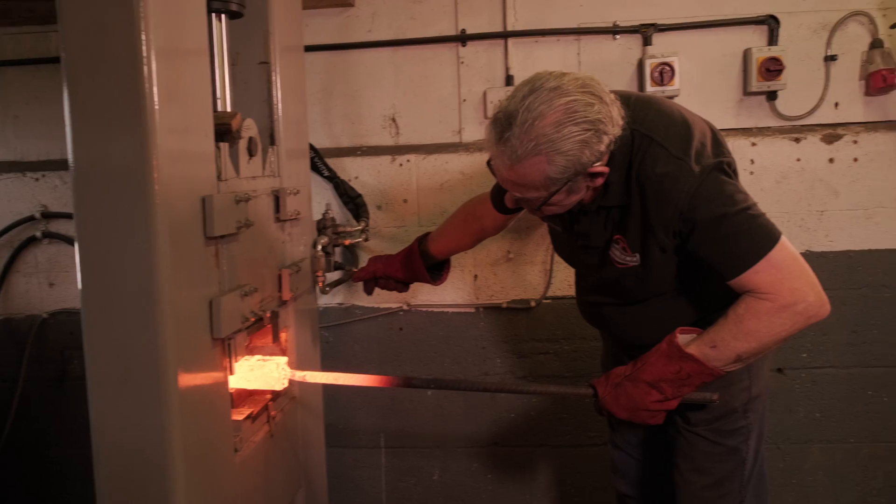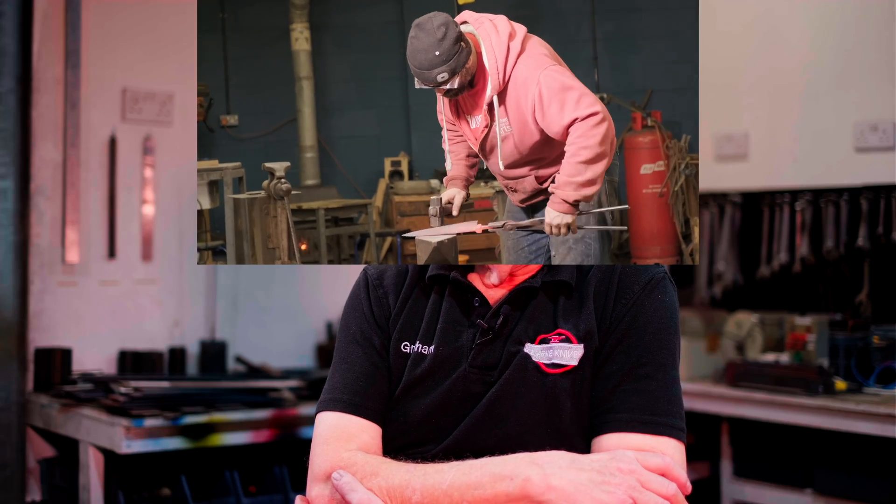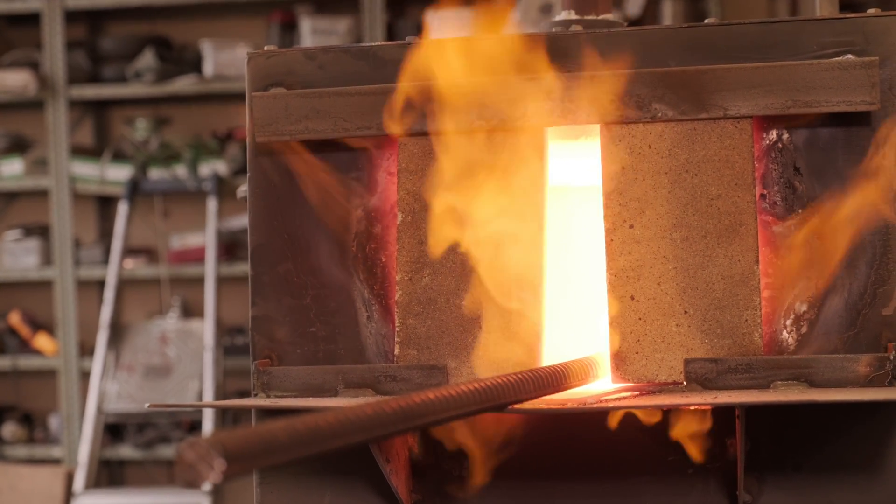Watch it and keep an eye on it. When you see it starting to glow dull red — that's around 700-800 degrees, a dullish to a medium red — take it out and give it a press or a whack. That's going to further set those faces closer to each other. By the time it starts going red it's beginning to soften; it's not hard steel like it was when it was cold when you were clamping the layers in a vise. Just a light tap or a light press. Bear in mind that if you're using a forge press, those die faces pressing onto the outside plates of steel need attention.